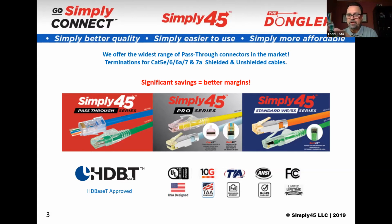So you get really three big advantages with a pass-through. One, you get to verify that you've got it wired in the right sequence before you terminate. The second thing is you can really minimize the amount of untwisted wire because you can push the untwisted wire close to the contact. This is how you really improve your performance on a connector, because anytime you untwist the wire, you're degrading the signal. And the third thing is you're going to get maximum copper on every pin.